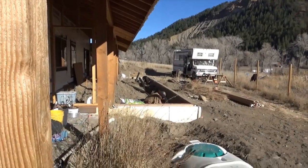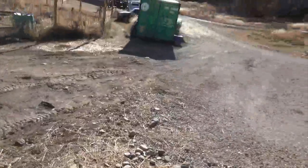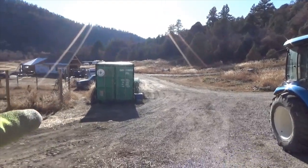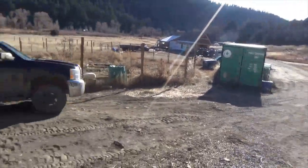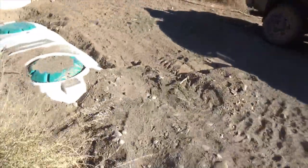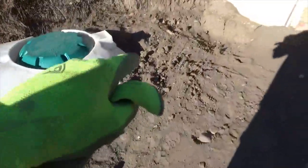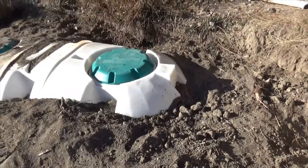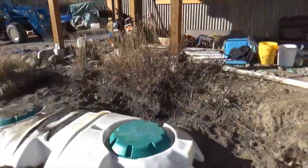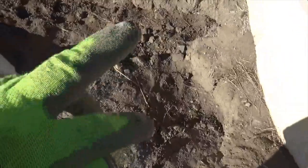We're working on the earth tubes once again. Earlier in the summer we had a huge 300-foot-long slot here, 12 feet deep — that's where the earth tubes are in and out. Alan cleaned and power washed the tank, we plumbed it and backfilled it. But this has taken maybe five or six 10-ton dump trailers full and it's still not full — we have to bring this grade way up. The earth tubes come in and out here and go under and next to the water tank, which will help heat that.